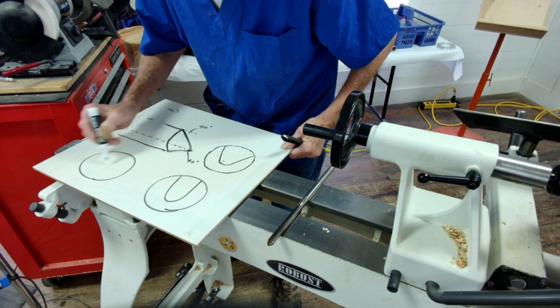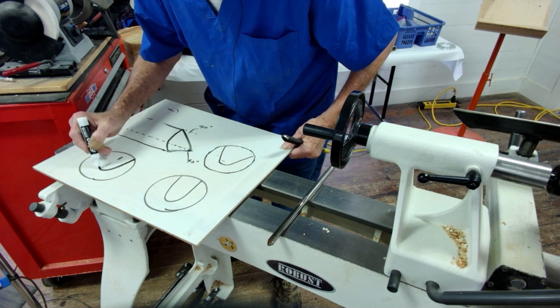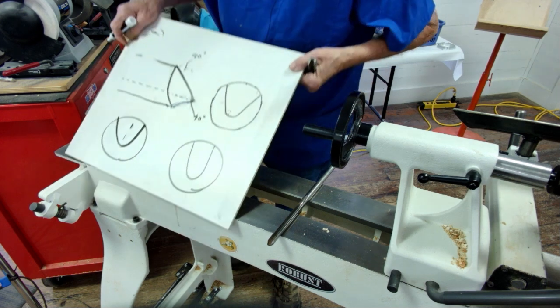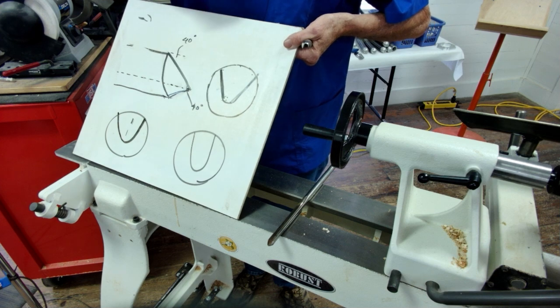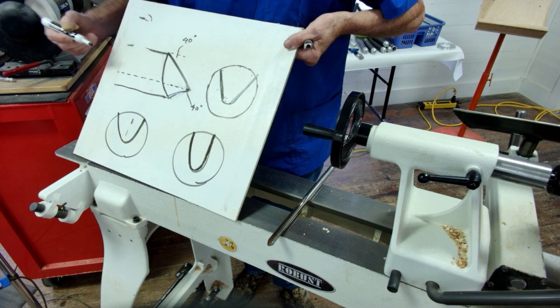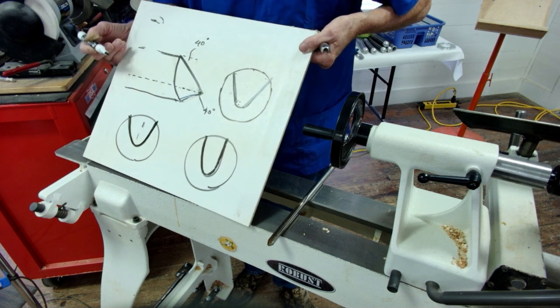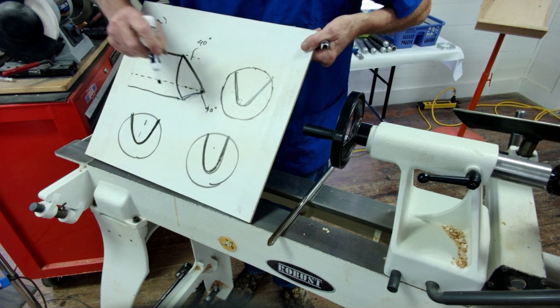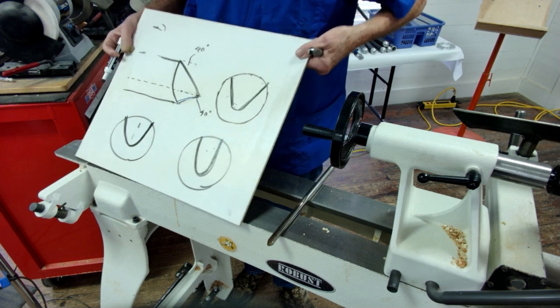Shape, and this is going to be, okay. This is a straight grind that comes in. Those sides are straight coming in on it. That's a U shape coming in on a U-shaped gouge, and this one here is an elliptical shape. There's a few companies that make this. The grind will not work on that U-shaped gouge.